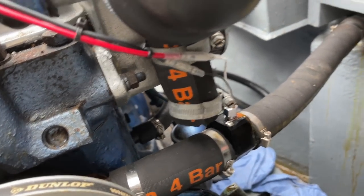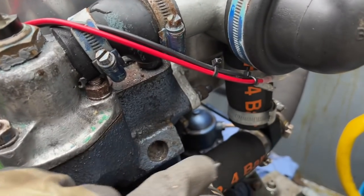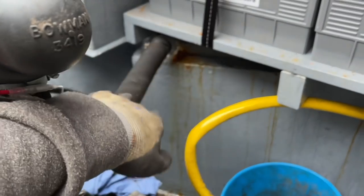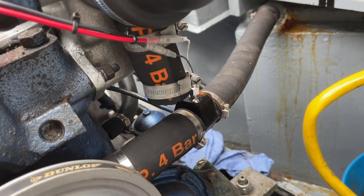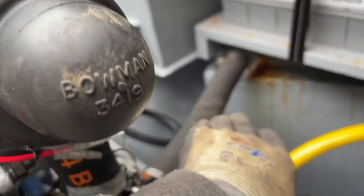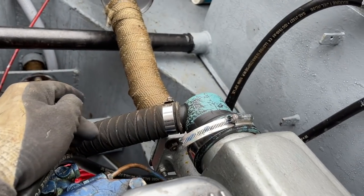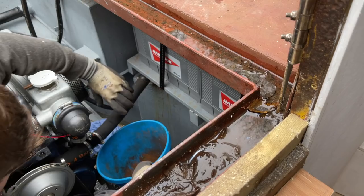I put this one in line but I think I've put it the wrong end, because the thermostat lets water in but it's letting the cold water in, so I put it on a cold feed. Just to show everyone that calls me a genius - I'm not far from it. So the plan of action is disconnect this, drain whatever needs to into the bucket, get some more pipe to close this gap up - a full length, I'm not going to try and plug it. Fit the temperature sender in here and then fire it up and see if I can get a decent reading up on my gauge.